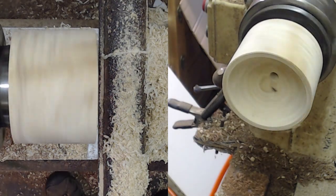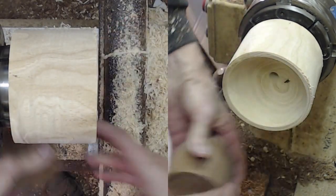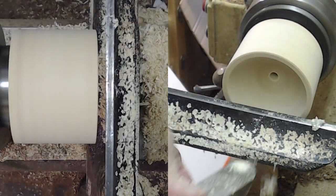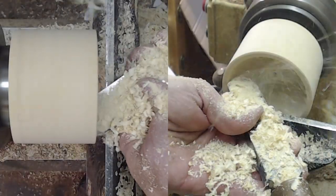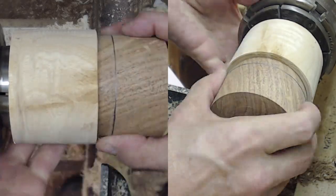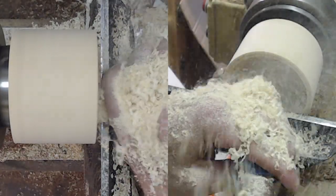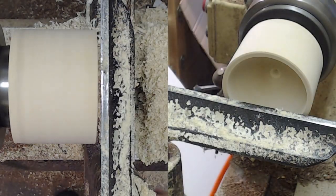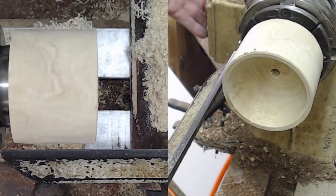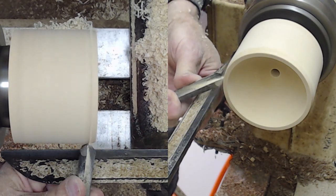At this point, test fit the sphere in the chuck. Aim for the top of the jam chuck coming within 1/4 inch of the center line on the sphere with a tight fit. In my case here, the jam chuck needs to be cut deeper to get the proper fit. Once you have the proper fit, taper the outside edge of the jam chuck.